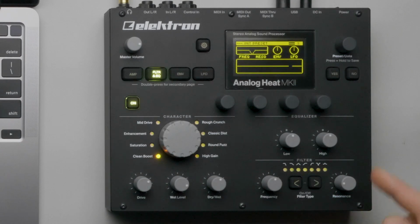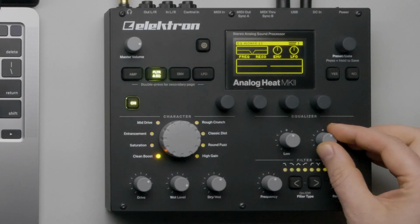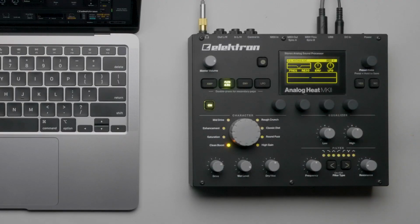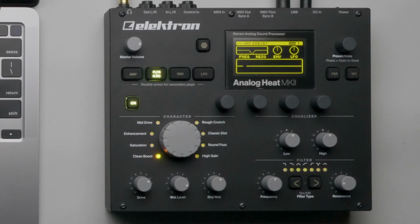The 2-band equalizer seems self-explanatory, but there are a few things to know. The low and high knobs are either cut or boost shelves. At 12 o'clock, they are at 0. Counterclockwise, they cut the signal, while clockwise from 0, they are boost. The manual makes no mention of the crossover frequency between the 2-band EQ, but it would be helpful to know that.